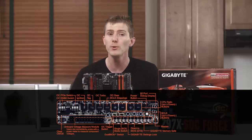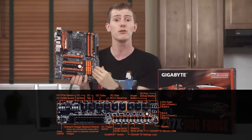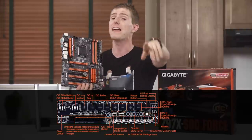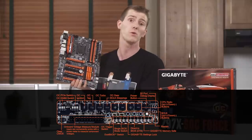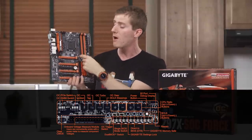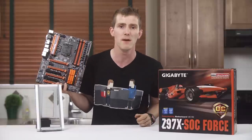The OC Trigger switch lets you boot up with a safe, easy setting, then engage it to jump to an aggressive frequency only during your benchmark run. The PCI Express dip switches let you turn the PCIe 16x slots on and off for easy diagnosis of issues when running multiple cards — a fantastic feature for water coolers and extreme overclockers when it can be a bear to pull a card out and find which one's causing the system to be flaky. And there's a related set of dip switches for the DIMM slots, so you can switch slots on and off one at a time to find out which one runs best or to diagnose a flaky stick without physically removing them.